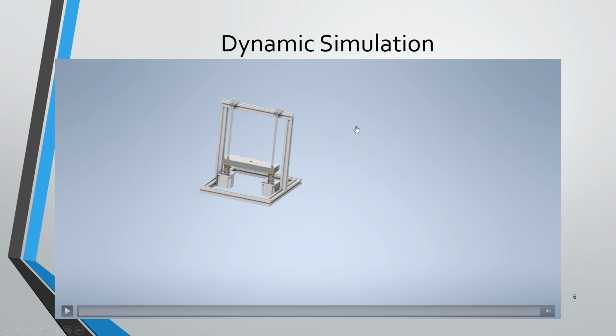So as I was saying, we used a different type of analysis. In this, we used a dynamic simulation. So Autodesk Inventor products allows for the dynamic motion of a component. Basically, you're able to apply forces and torques that are known in a very simple model that can then be transferred into finite element analysis. And so once you export these motions, it then turns everything into torques and moments on each part that's being acted on. So any load-bearing part will receive a finite element analysis while this is in dynamic simulation mode.